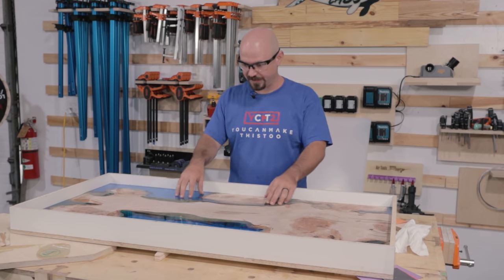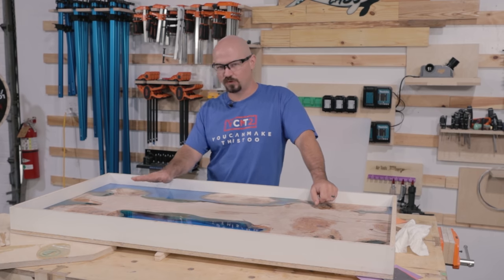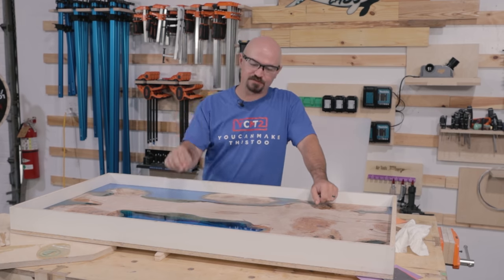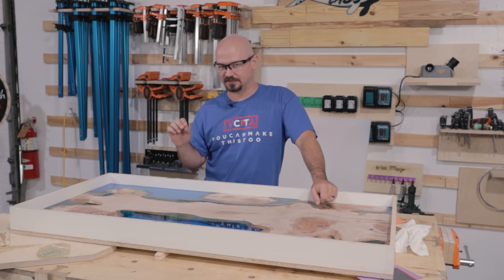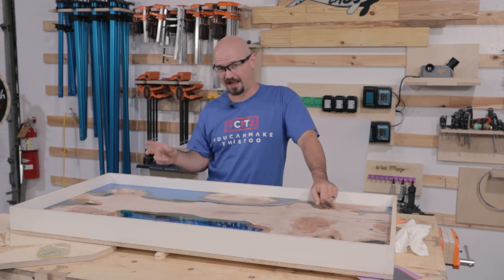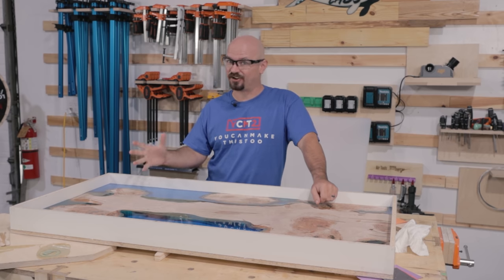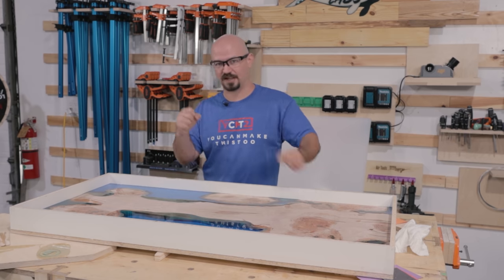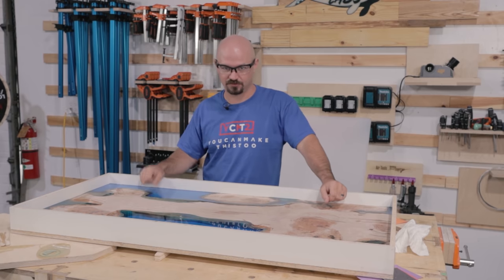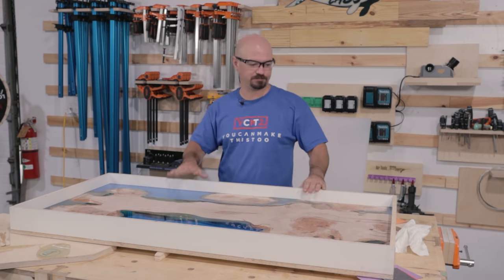One of the things we're gonna be very careful of when we flatten this is to try to keep it just proud of the wood, so we'll have a little bit of sanding. One of the things we definitely don't wanna do is touch any of that thick set when we flatten, because since it did go just a little bit exo, whenever epoxy goes exo and you try to machine it, it tends to shatter and kind of explode. It doesn't cut nicely. So we definitely don't want to do that. Otherwise, we're going to have a bunch of chip out and stuff. Just a big tip for flattening epoxy. So yeah, let's take this thing apart.